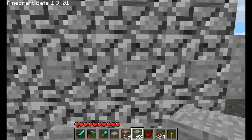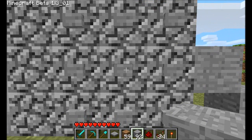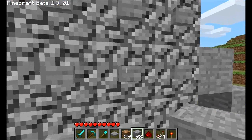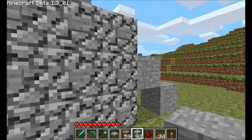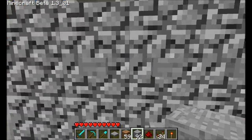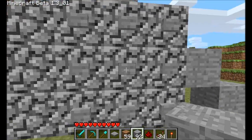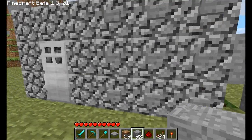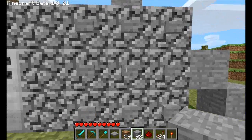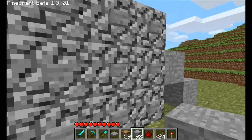One thing you need to note is this middle button right here — that one's going to pose some problems. It's nearly impossible to wire without crossing or shorting out other circuits. So the only way to get this one to be a viable button is if the code does not use this middle row at all, and then these three are all set as bad buttons. All the buttons that are not part of the code are wired together and go to the reset. If this whole row is reset, then you can use this middle button, otherwise you can't.